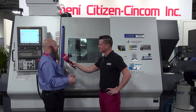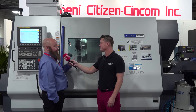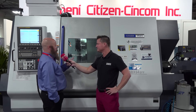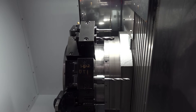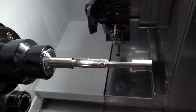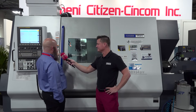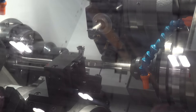We also have the ability to reverse course and back the program up to the last tool change. The guiding philosophy for the design of this machine is complete part — no secondary operations off the machine. With the two turrets and twin spindles, we can do the front side, transfer, finish up the back side, collect it, automate the collection process, and automate the loading process. It's really designed to be self-contained with as little operator input as possible.